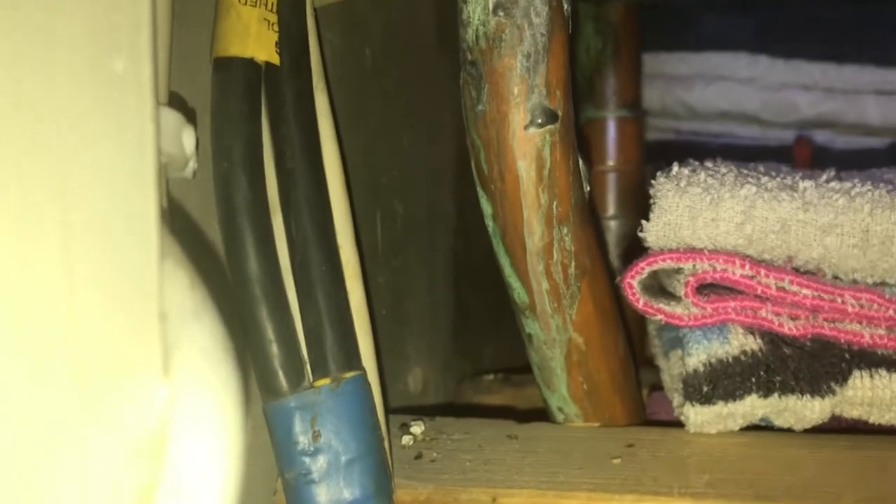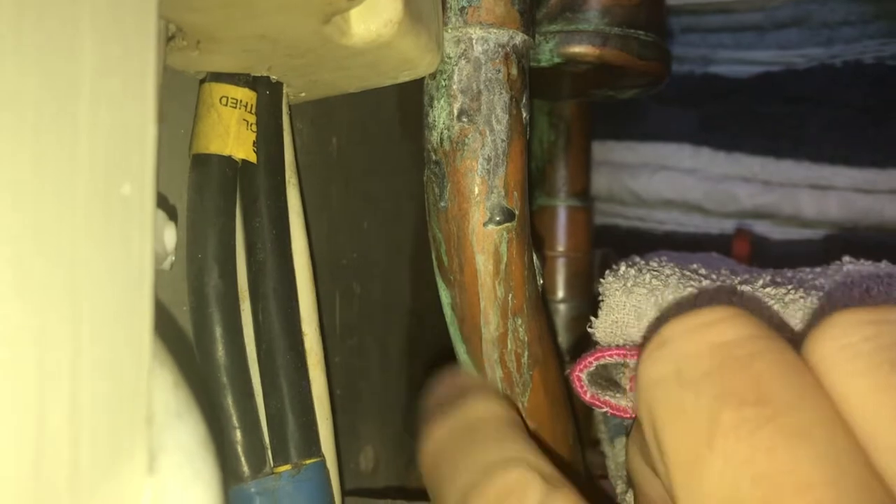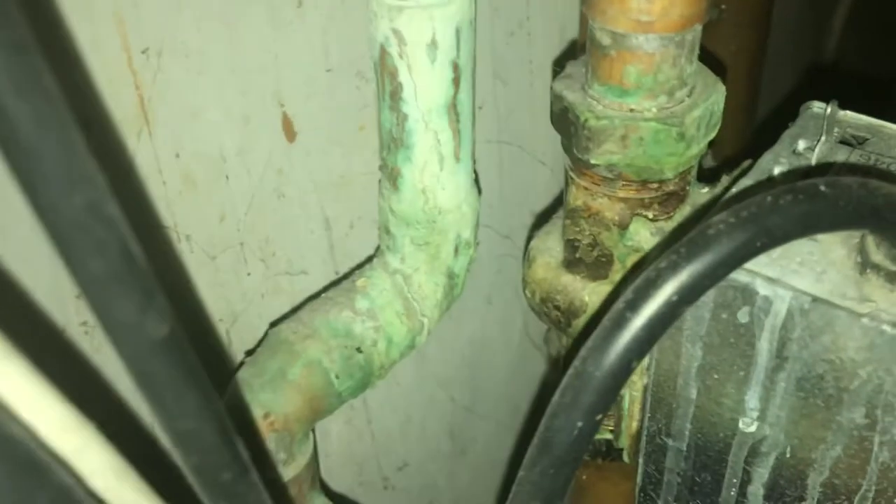Same as down here, a bit messy. But you can see where this tracks down — there's been a run here — and that's a bit encrusted. That is where there has been a leak. Down here you can clearly see where it's white and more encrusted. This is where there's been a leak, less like Verdigris. And down here, really bad, really encrusted, not smooth — this is where there's been a leak, but there's no leak at the moment.